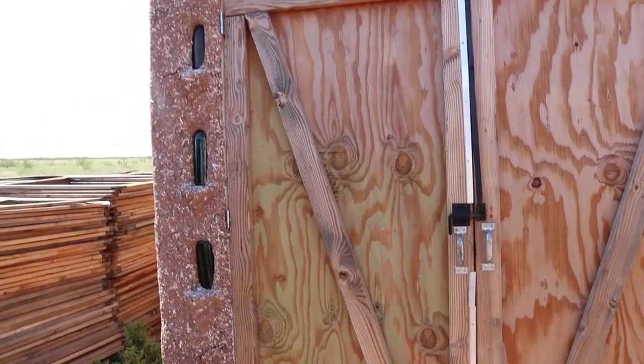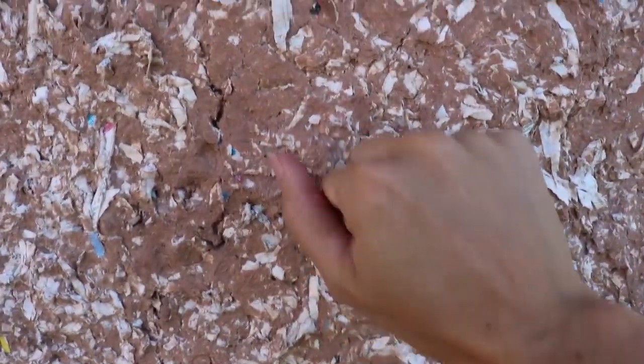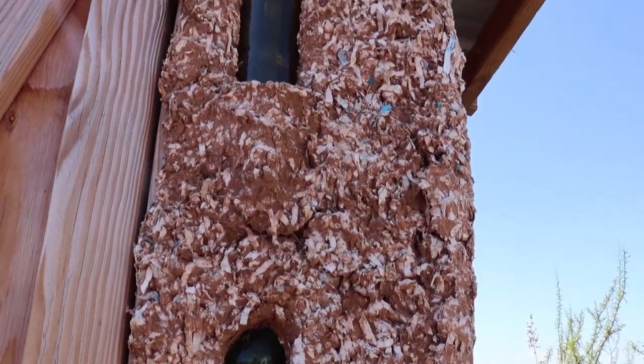What makes this shed really unique is the way we built it. The walls of the shed are filled out with what's called fiber adobe — it's basically just a mix of earth and shredded paper. It was a really great experience working with the fiber adobe and it's surprisingly durable for a material that is literally just dirt and paper. So even though it's been sitting out here for over a year exposed to the sun, the wind, and the rain, it's really in surprisingly good condition. You can see some areas where the soil has worn off, looking a little more white from the paper being exposed, so now it's time to go back over the walls and finish them off.